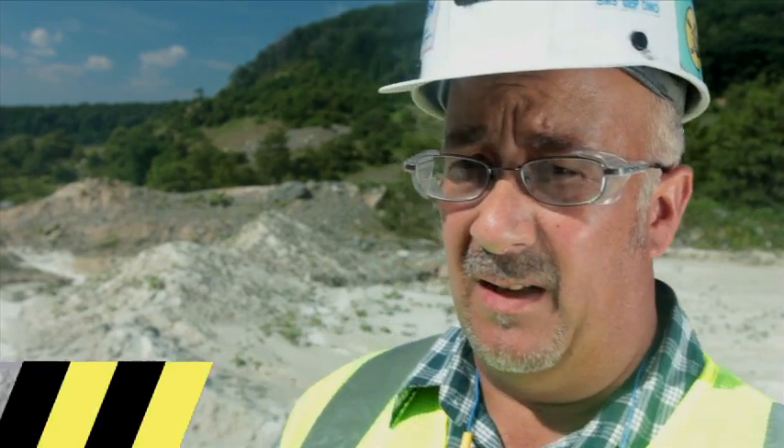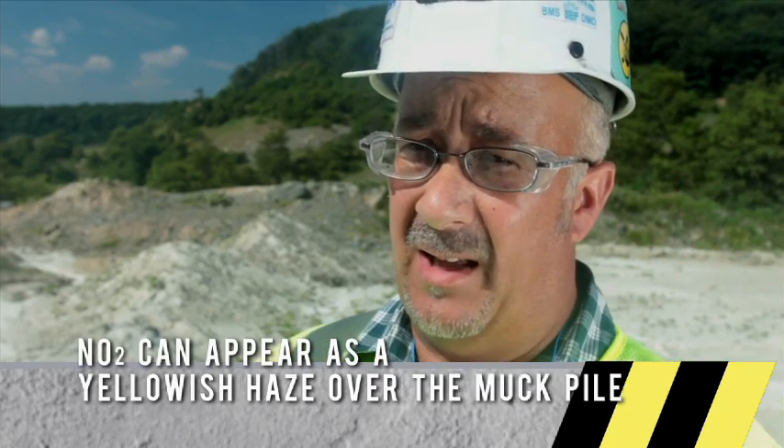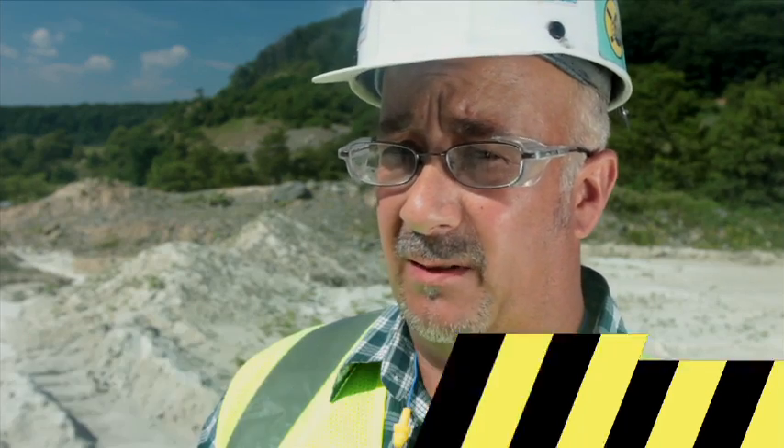Approximately two years ago, I entered the mine one morning and walked into the shot area and noticed a yellow haze — that's nitrogen dioxide — and that's a very dangerous gas. It burns the respiratory system and can be fatal. I was carrying our Passport gas detector, which goes off at three parts per million, and it was a little higher than that. Keep out signs were placed farther back to cordon off the area and left vacated until time cleared the gas. A report was made in the log book of the occurrence. It wasn't necessary to evacuate the whole mine — just necessary to keep people out of that area.